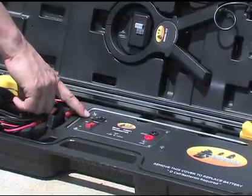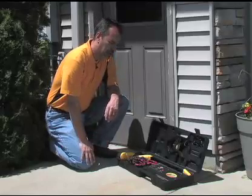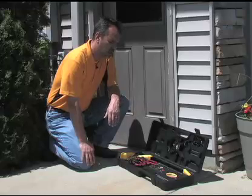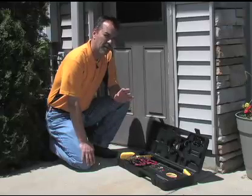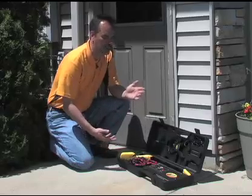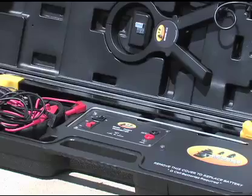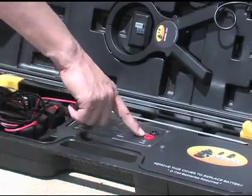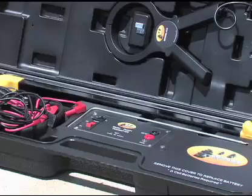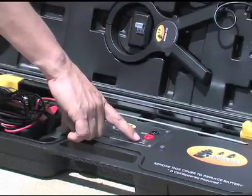This control here is for low or high frequency. The 871C is a dual frequency locator. You can operate it on high or low — your choice. But you do have to operate the wand and the transmitter on the same frequency; they both have to be on low or both on high to work. The alligator leads clip in here, red to red, black to black. The inductive clamp plugs in here at the port named clamp.